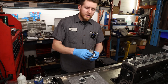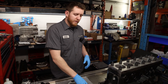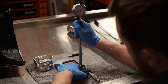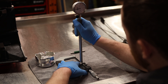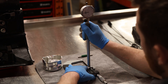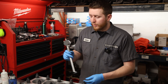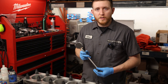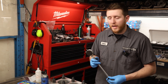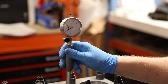On this application, each piston varies a little bit, so we've machined each piston to fit inside its specific hole. We'll repeat the same steps for each individual piston. Just like last time, we zero our bore gauge inside the micrometer — left and right, then back and forth — always at eye level, because the vantage point of the needle will change the reading. The piston for this example is piston number five, and we're measuring piston-to-wall clearance in cylinder number five. Our expectation is three and a half to four thou of piston-to-wall clearance — that's the standard manufacturer spec for this setup and the conditions this piston will live in. We're seeing about three and a half thou right there.